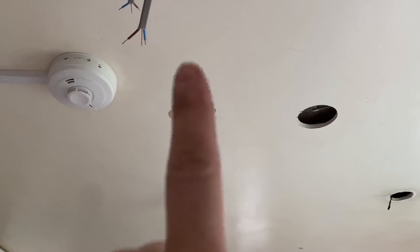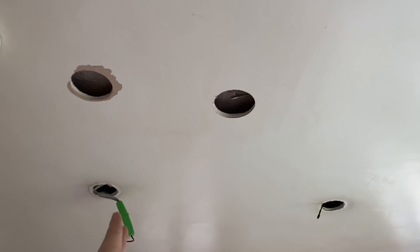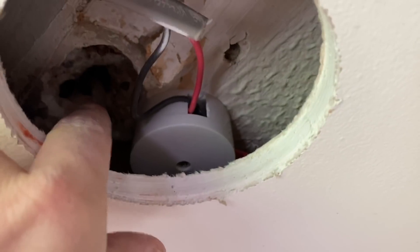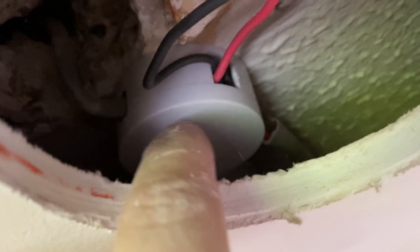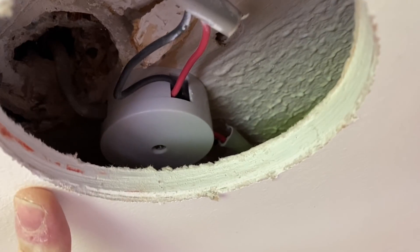I did a junction box up there on that broken cable but that didn't fix it. The cable went through and there's a line of buttons here, so I figured there must have been a centre light in the ceiling somewhere which they took down and did the junction box. I drilled a new hole and found another junction box — you've got a concrete ceiling with conduit and the twin-and-earth cable comes out of that into there, and then one goes out to the other side. All I've got to do is get rid of this junction box and redo the connections.